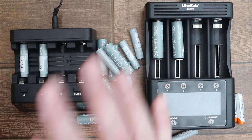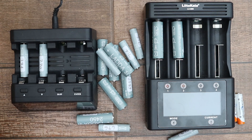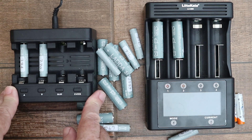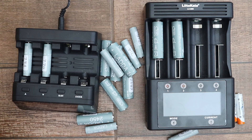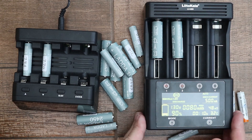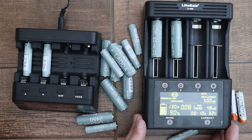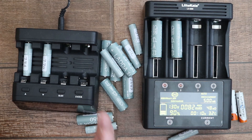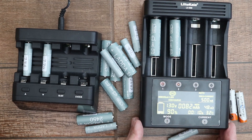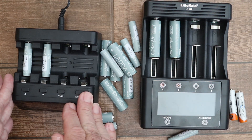I just found out that the PowerX charger is wildly out. When I discharged and charged the 2450 milliamp hour AA batteries, I got readings of between 3200 and 3700 milliamp hours with the PowerX, which is way too high. On the other hand the Litokala was right on the money, giving readings of the exact rated 2450 milliamp hours plus or minus 150 milliamp hours or so. From now on I will take capacity readings using the Litokala because of the inaccuracy of the PowerX.